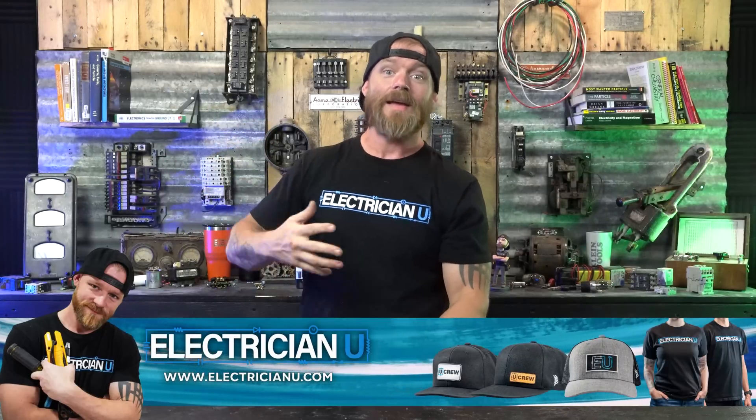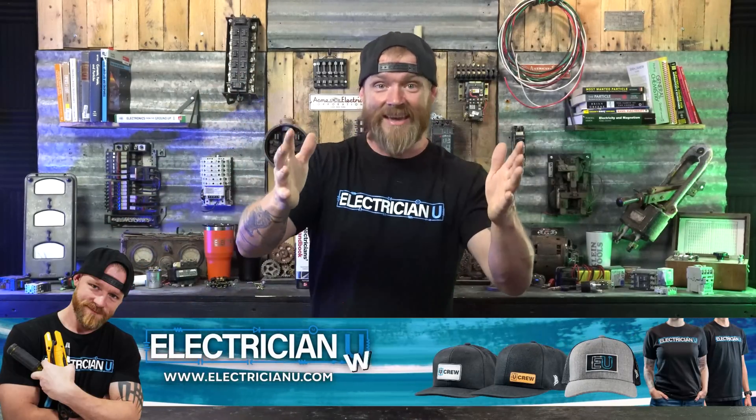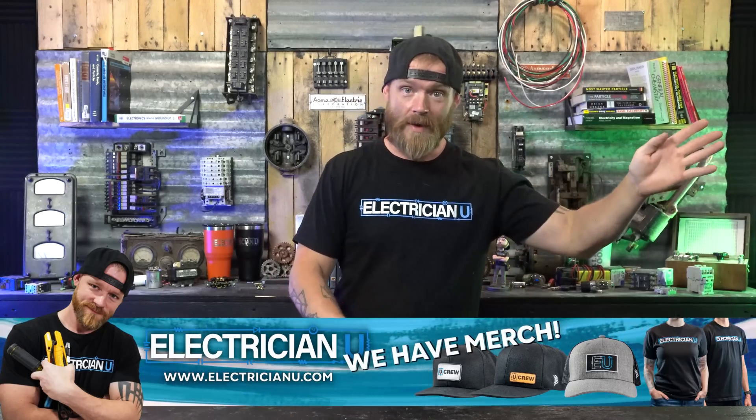I have a 42-circuit panel and tried to get a 42-circuit cover from a new panel at my supply house, but it was three inches too short because it's an older class with different dimensions. I've contacted Siemens and gone through the whole gamut and cannot find a panel cover. So unfortunately I'm going to have to pull this panel out of a fully finished painted wall — with home runs coming in from the top and custom-cut conduit from the bottom. It's going to be a nightmare.